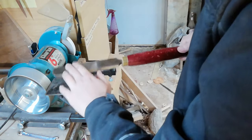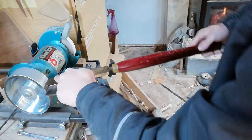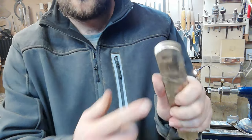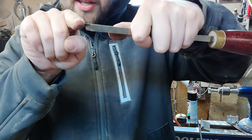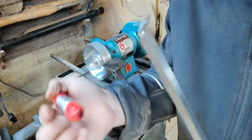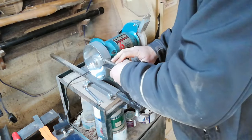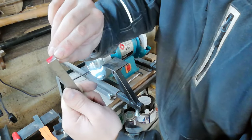After adjustment we've got the sharpie removed all the way from bottom to top — that's our correct angle. Turn it on and grind. You know when a scraper is sharp when you're getting tiny microburrs over the top with an equal edge all the way around. If you're just touching up and there are little bits at the bottom not completely straight, that's not a problem — it's the top edge doing the scraping action. For a proper accurate grind, blend all the way to the bottom. Box scrapers are really easy to grind — same sharpie process, find the angle, rotate the wheel away, and grind square across the top with an equal bevel.